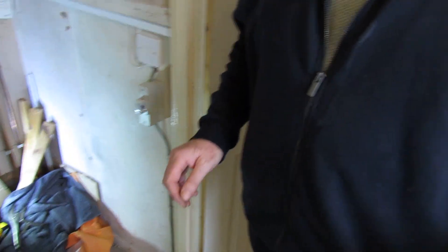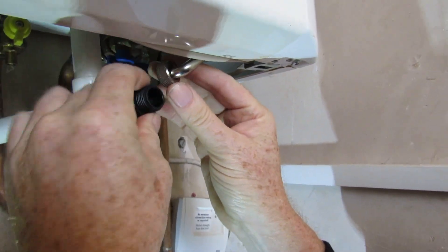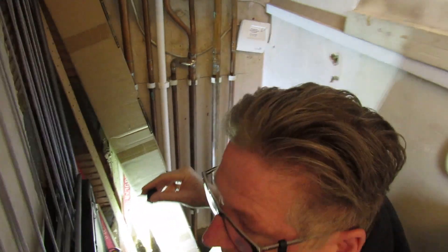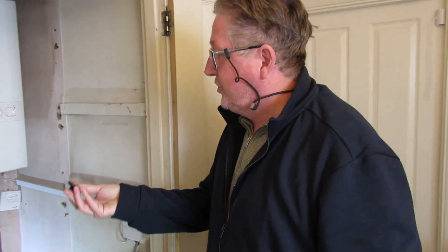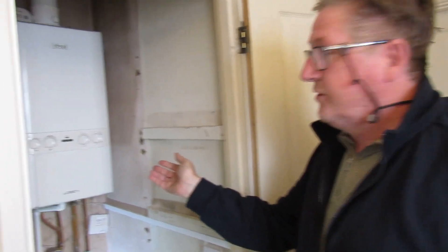We've undone our fill loop pipe, but unfortunately none of these fittings work — it's all too small. That adapter really needs to fit onto there, but it's just too big or too small. So we're going to have to do it through the radiator instead. This is a good part of the video to show that this is not a universal fit for all boilers, which is a bit annoying considering it claims to be. Our boiler is an Ideal Logic, about 10–15 years old — just bear that in mind.